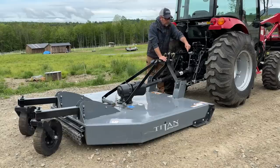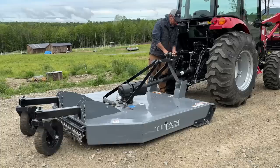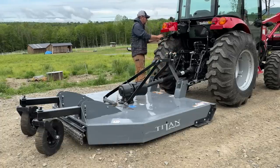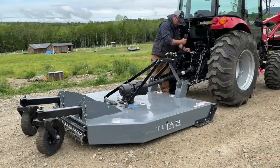So the corners where the black brackets are, we're digging in a lot of areas. What I think ended up happening is our nut loosened up and this whole thing shifted. So we're not level. I want to get this adjusted so we are level, and then I will tighten back up that lock nut. And then hopefully we won't be digging in on the corners.